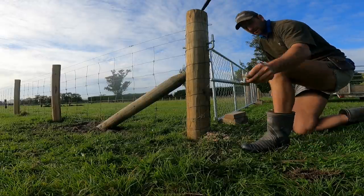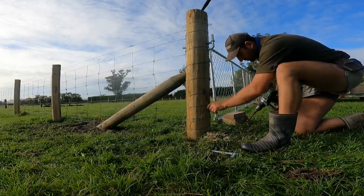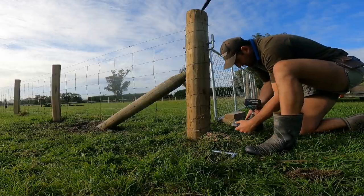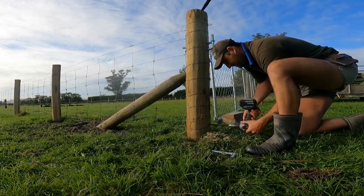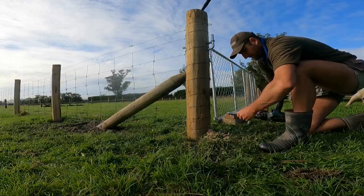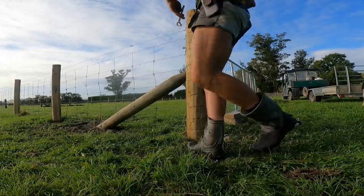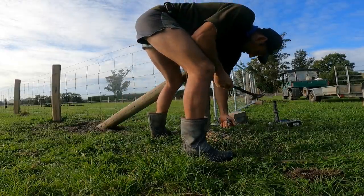So we're just using a screw-in gudgeon at the bottom. And so we need to change our bit, make sure the hole's slightly smaller. Sure that'll be enough. Yep. So we'll start it off with a hammer.